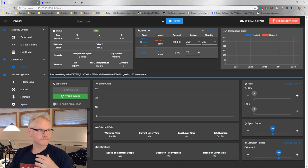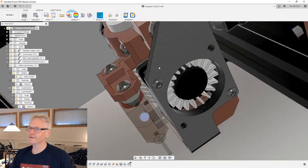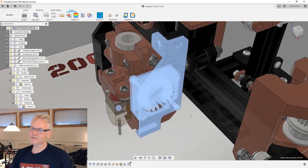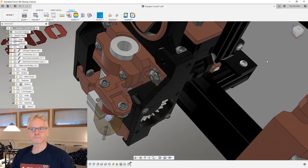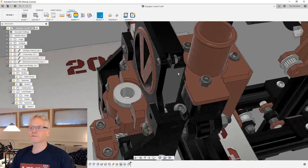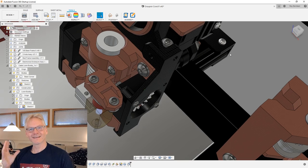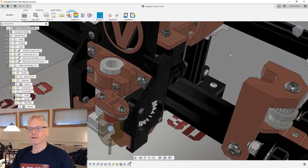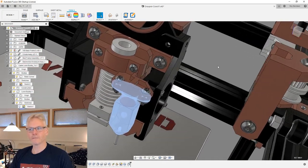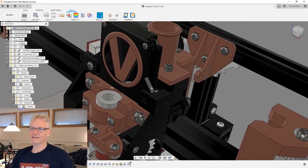So what are you guys saying? Yeah, Scott, I was thinking about placing it on the side here. But the thing is that this bracket is not very rigid, and it might bring some vibrations from this fan over to this bracket and off to the BL Touch. That's also something we need to think about when we're placing stuff, how flexible things are, because we don't want the BL Touch to be affected by vibrations. And by placing it like this, we don't have so many vibrations anyway.